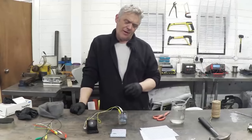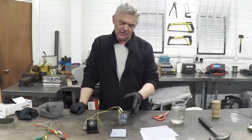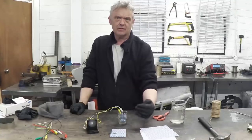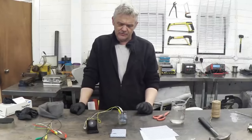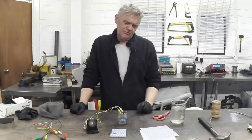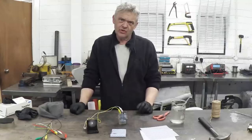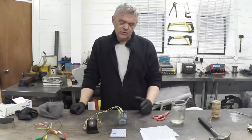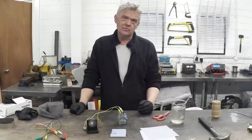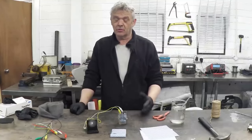Now, when you think about that Bennett battery, actually, it begins to remind you of other things. I mean, what we've got here is a bit of iron in a KOH solution with a metal contact. Now, that metal contact, obviously, makes you think it would be independent of the kind of metal that was used. And if you think about the iron, if we used nickel with that, then we would have a nickel iron battery. And if we used cadmium with it, then we'd have a nickel cadmium battery. If we used carbon with it, then we'll have that original battery that was developed by the Swedish guy, I think, that Edison is supposed to have stolen and replaced with nickel.